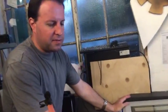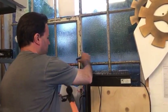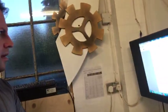Oh, are we burning stuff now? Yeah, these particular high quality fibre boards have a lot of resin in them, and the laser doesn't penetrate the resin so easily, so you can crank the power up or reduce the speed, which is what I'm going to do now. Fantastic. So I didn't manage to penetrate to the back surface of the ply. We've only gone through a few layers. Shall I wait a second? Yeah, you can do. Right. Investigate, delete the job.